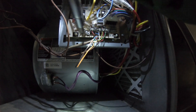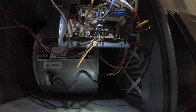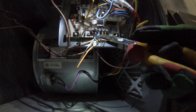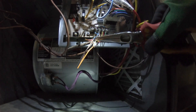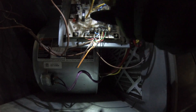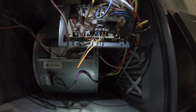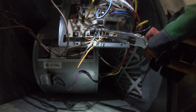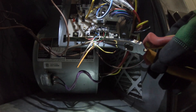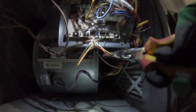What I do is disconnect R — that's just to disable the smart thermostat, we have a Nest — so I don't want to short it out. I always disconnect R, and then we're disconnecting Y: that's the wire that goes to the thermostat, and this is the wire that goes to the condenser unit. I like to disconnect both, and then we get a jumper.